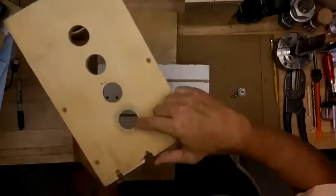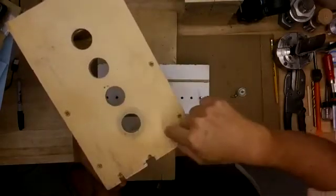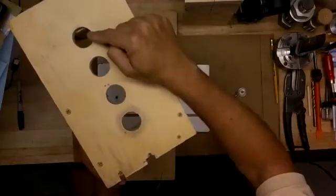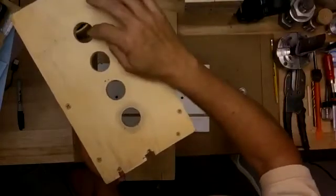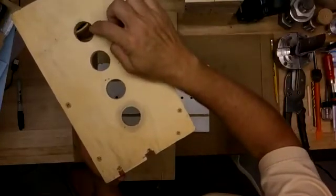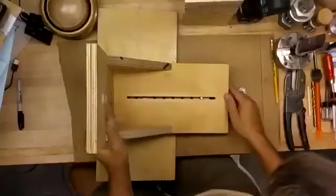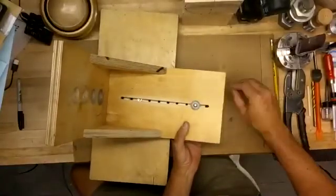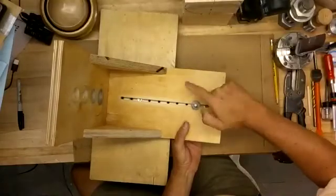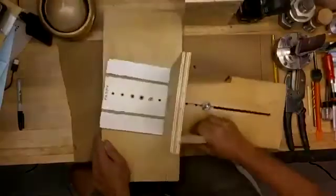And the height of these, this one is about 3 inches up. So it would handle a 6-inch hole. And this one is half the distance of the height of my saw. And I have a pretty tall bandsaw for my 3rd bandsaw. And so I can come up here and make a pretty big bowl that's going to fit. So this carriage sits on top of this plate. And it gets put on with a washer and a wing nut. And now it can slide. So I can adjust it.